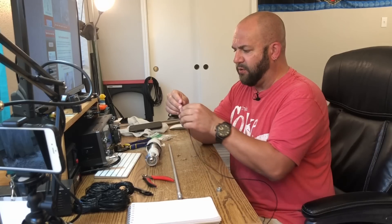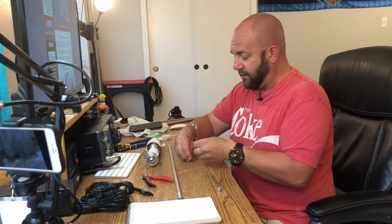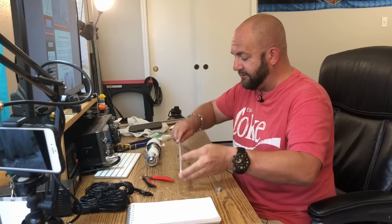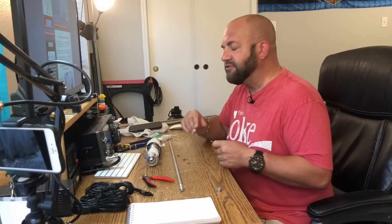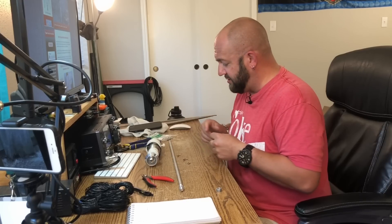I've got a little bit of DX10 wire to try out along with extra DX Commander wire. I want to make five of them — still using the conventional three counterpoise wires on the legs, one wire per leg — but I want to see if I can cram five wires into the ring terminal. 33 feet is about 10 meters, so divided by five that gives us 2-meter counterpoise wires, about six feet seven inches. Everything in meters — the imperial system is stupid, metric is awesome.